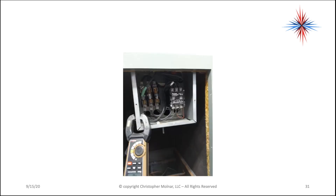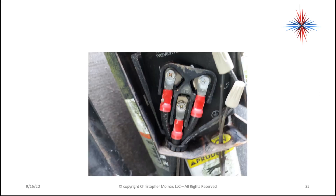A way to identify a three-phase system: a lot of times you'll have a three-phase contactor — that's one, two, three. You might also have three fuses someplace along the way, or on the breaker panel it will be a triple breaker. The compressor has three connections; we still have three winding connections.